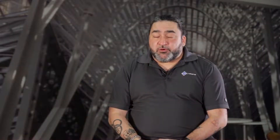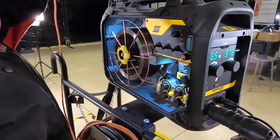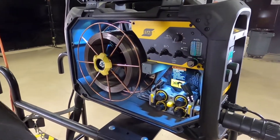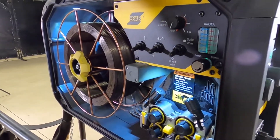The gas in GMAW is very important. In the past, only inert gases were good for welding, but as technology advanced we were able to put different elements into the wire. That changed everything. Now we could add small amounts of oxygen to the gas to increase heat.